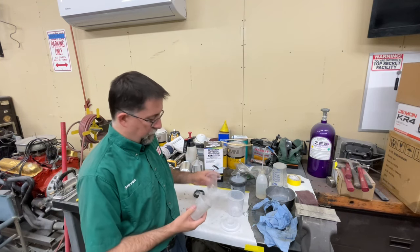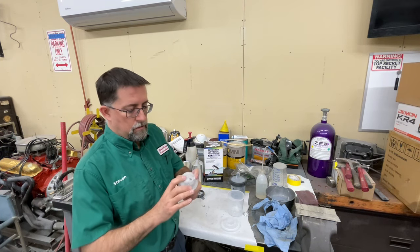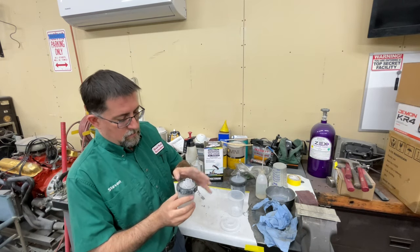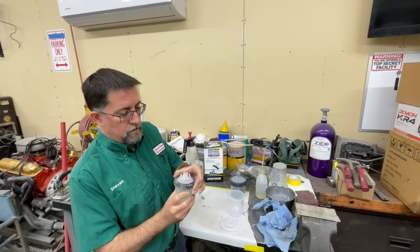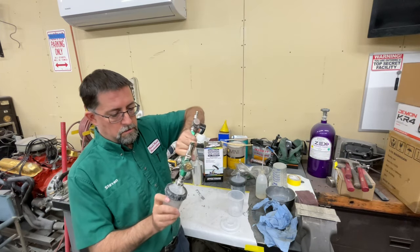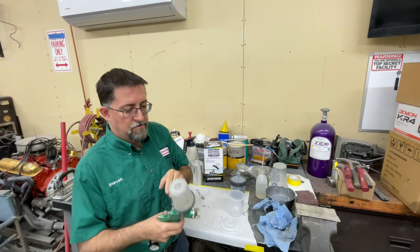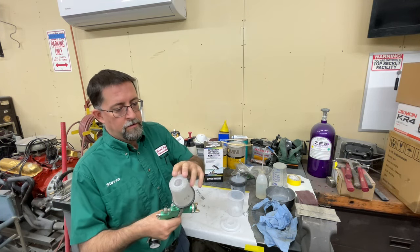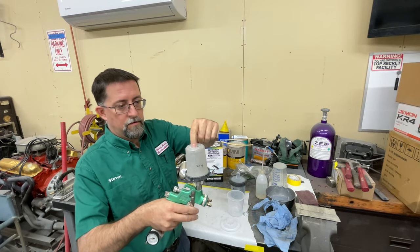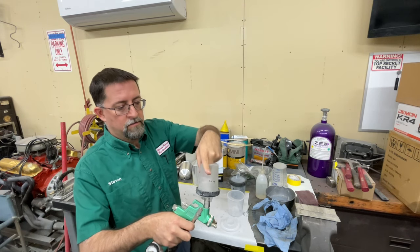Basically you have your cup, stick your liner in there, put your material in, snap the lid on — obviously you want to keep it upright so you don't spill it. Put the locking ring on, attach it to your gun, give it a quarter twist and you're all set. As you're spraying it's going to create a vacuum — the bag will just collapse. As soon as you pull the trigger, it lets you push all the way down.